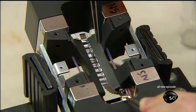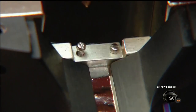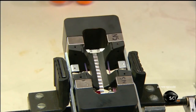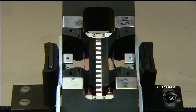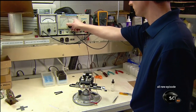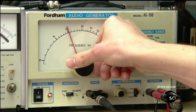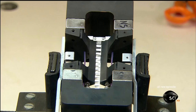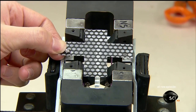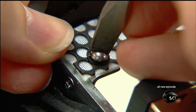In this position, the moving ribbon is a conductor in a magnetic field, generating a tiny current — an electrical replica of the sound wave that can be recorded, amplified, or broadcasted. A technician tests the ribbon's tension to ensure it's neither too tight nor too loose. He hooks up the terminals to an audio signal generator and measures at what frequency the ribbon resonates. If necessary, he tunes the ribbon by adjusting its tension. He then installs what's called a puff shield, which prevents puffs of air from stretching or tearing the delicate ribbon.